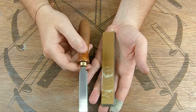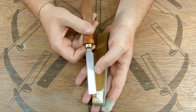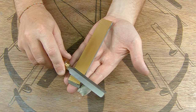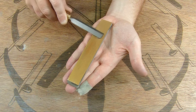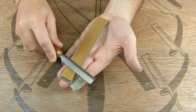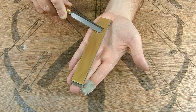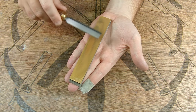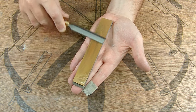The back side is hollow ground, and you can see there are two lines on either side because it's hollow in the middle, so you have that dark area. What we're going to do is just sharpen flat — it's small, like a slip stone. We're going to go literally back and forth flat, and you can see the black on the stone already starting to appear, which means it's cutting the metal because diamonds cut everything. I'm not putting too much pressure, making sure I'm flat — I don't want to tip up or roll down. Just staying nice and flat. If you want to do single strokes you can, but make sure you're going in the same direction — forward and backward — so the scratch pattern is going in that same slant.